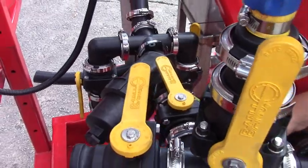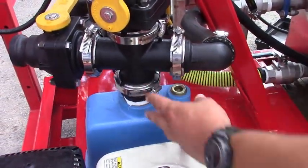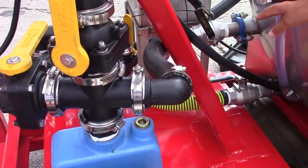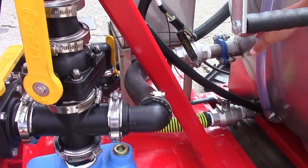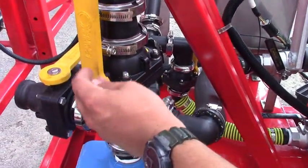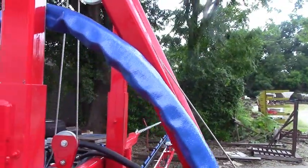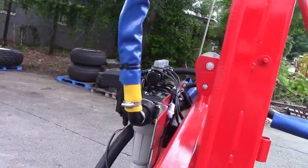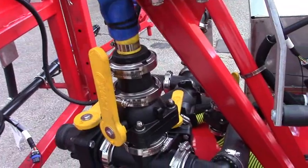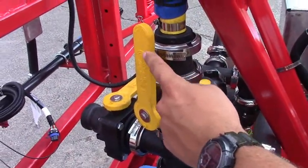It's going to come into the pump and go out the pressure side. At the pressure side we have a cross — a lot of your water is going to go back and go into your sparger tube for agitation. The remaining water is going to go up through this hose and into your valve. It's really important that when you're loading chemical in the chemical inductor, you have this valve off.